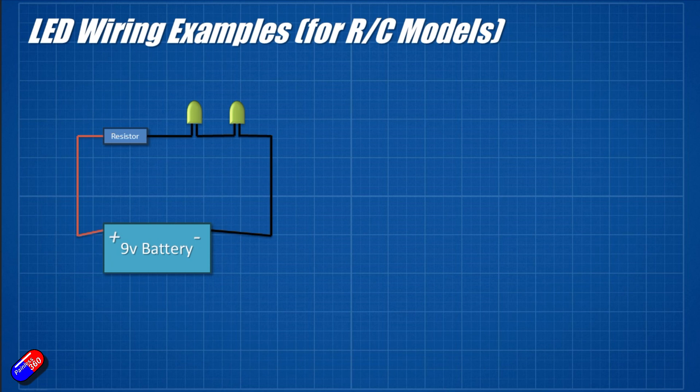If they are run from 9V, they're going to be quite dim, because the internal resistor that's usually part of those devices is designed to get them to their nice brightness on a 12V supply. But let me give you an example. If you're running a 9V battery, I'd use discrete separate LEDs as covered in the first video. The circuit is going to look like this: we have a 9V battery, a positive wire going through a resistor — we'll calculate that value in a moment — and the current flows through each LED in turn before going back to the battery. The current needs to be about 20mA typically; check the specifications for your own LED. Because they're in series, that 20mA flows through each of them, so we only need one lot of 20mA.